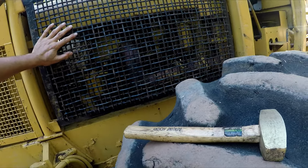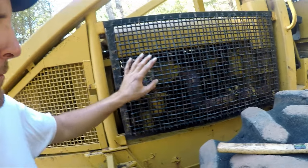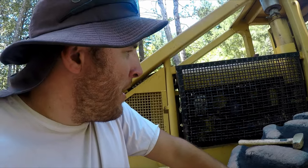So these Detroits have a blower motor on them. This is the NA one with just the blower. I think some of them have turbos and the blower or something like that. Feel free to drop a comment down below if you know more than me. I don't know much about these Detroits. All I know is we had an old 518 skidder with the Detroit in it, and we never worked on the engine. That thing started every time, and they're super loud. They're two strokes, and they have a blower on them. The good thing is they usually start, and I believe they're a little on the lower compression side, so starting them in the winter is a little easier compared to some diesels.